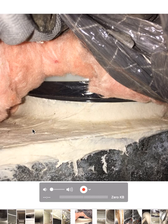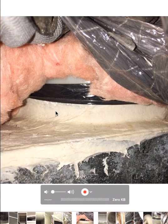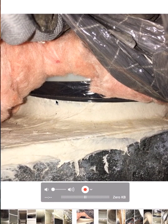This is where there's a platform that's been properly sealed — this looks really good right here. However, this does not look good. This flex connection is generally barely holding on with that zip tie because of how high up there it is, and there's no mastic covering anything to really secure it into place. So air can actually escape right through there. Even more important than that, it could pop off — I'll show you a picture of that in a second.